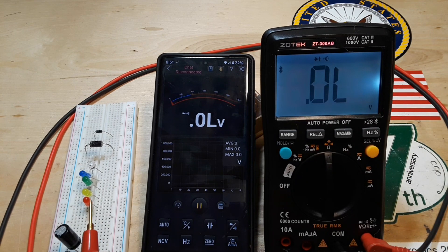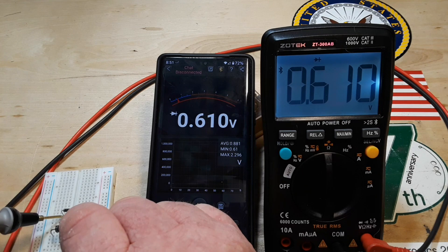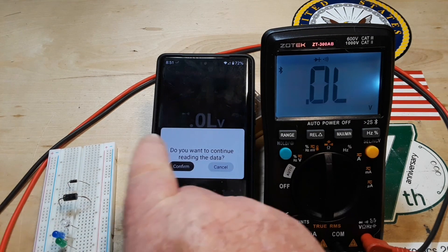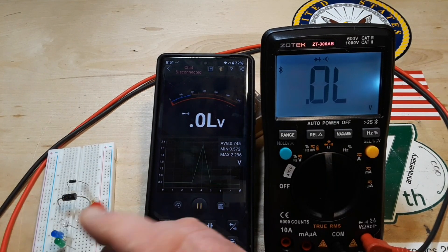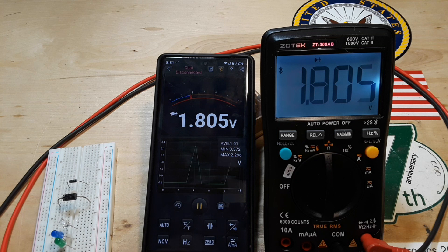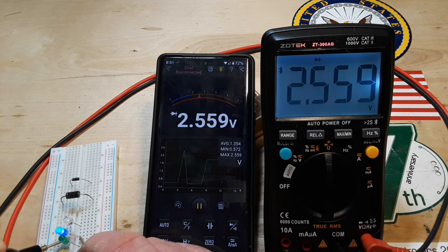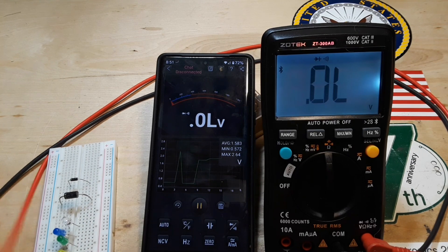Now diode test. Here's our first one — this should be a little silicon junction diode, and it is. This is just a larger one for power transformers. Now we'll move on to some LEDs. The red one should be the lowest, lighting at about 1.7 to 1.85 volts — reading 1.805. Yellow one should be about the same — 1.9. Green one should get right around 1.9 to 2. Blue should be right around 2 volts — reading 2.5. And the white should be somewhere close to the blue — 2.6. It's all looking really good.